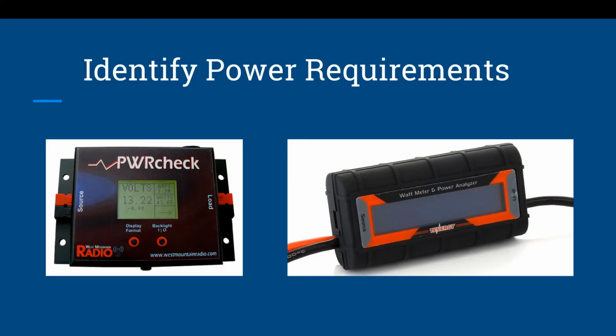Now, you can also use a much cheaper item called the Tenergy watt meter, and I'll include the link to this without power poles in the description below. You can get it for about $15, $20 on Amazon without the power poles. Now, the only caveat with these is it will tell you your time and your amp hours and your watts, but the minute you power it off, it loses all data. So before you power off, make sure you track and record what your information was. And so once you know what your power requirements are, you'll better be able to identify what your solar panel needs are to be able to match your power requirements.